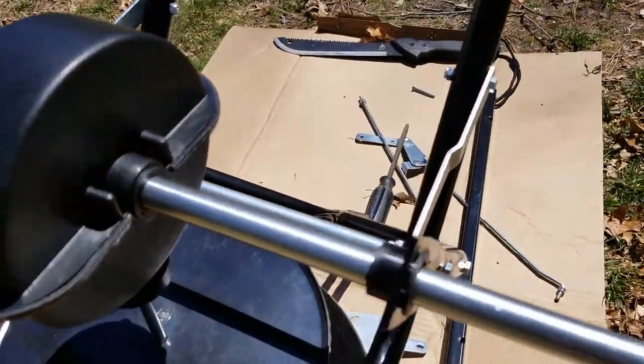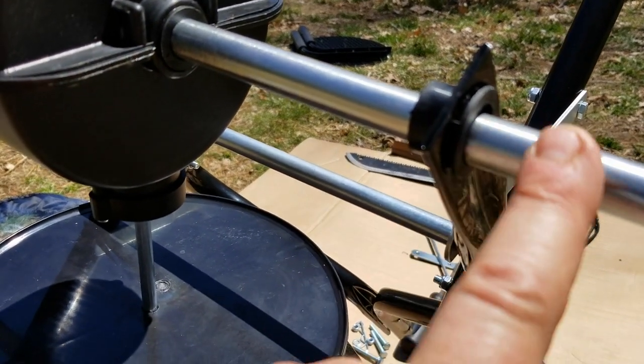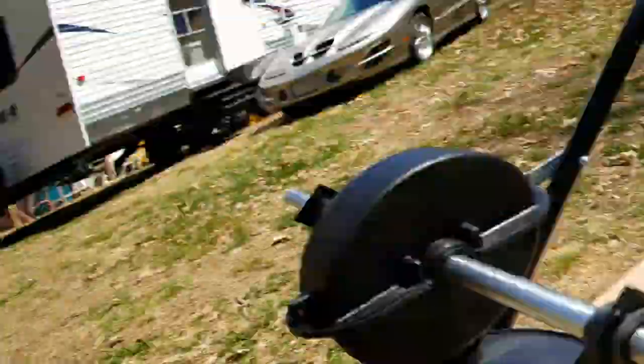And they weren't, so we just had to take a quick little lunch break and go back, and I dismantled the two sides. What you have to make sure of is that the flange is on this side, and that is the side that you want it on. It wasn't looking right and it kept sliding off, and I thought, oh, this has got to be the way it is. Maybe something else holds it in place, but nope. So both of them are reversed now. It is the way it's supposed to be. At the factory, somebody must have slipped them on the wrong side in the package for some reason. It's no big deal. It's only 2 bolts per side and nothing's cranked down, because you don't want to crank stuff down until it's complete.